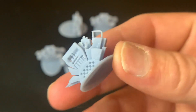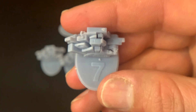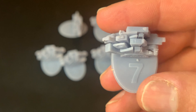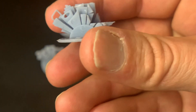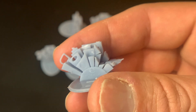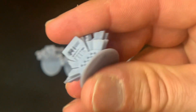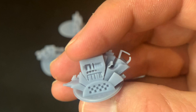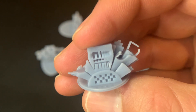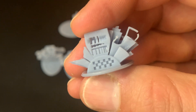I'm just going to show you guys the underexposed sample first. So this is number 7 — that would be the first section where the lights shut off, I want to say around 0.8 seconds. You can see that this print clearly failed; I'm missing quite a few parts of it. And if we look at the back, which is what I mainly focus on, we can see there is no gap between the separations within the measurements. There's all kinds of issues here — this is obviously dramatically underexposed, so we'll just toss that one out.